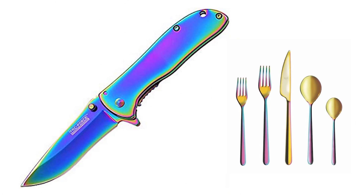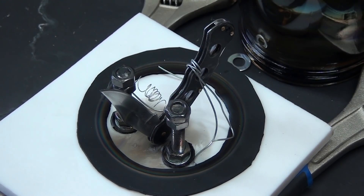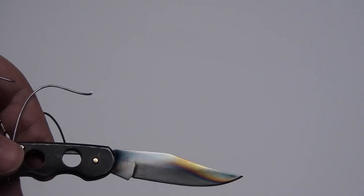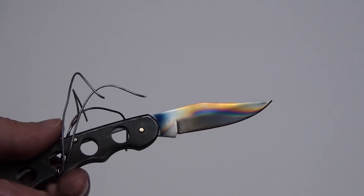You can get a variety of metal parts with rainbow titanium coatings. I wanted to try this myself, so I found the smallest knife I had and made it fit into the chamber. I put the blade edge first facing the filament to try and get a nice coating over the whole blade. After a 20 minute coating, I took the blade out and it was already starting to get some color. To really make it pop, I hit it with a flame for a moment and sure enough the colors brightened right up and I got a beautiful rainbow.